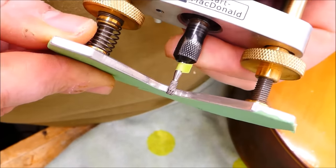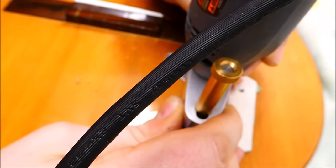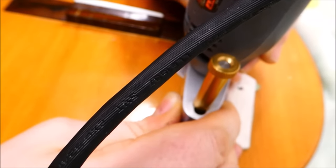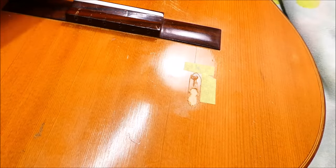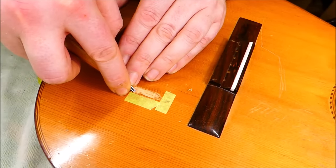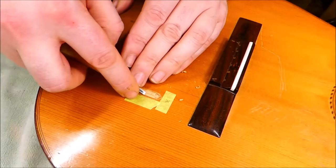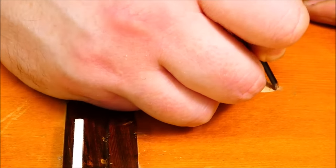With the plug held very carefully in position, I'll scribe around it with the point of the knife just to mark it out. Then I can remove the plug and deepen those incised lines until they're about the same depth as the damage in the soundboard. I'll use a small high-speed steel cutter in my Dremel tool. I'll leave a little around the outline which I can pare away with a chisel - just going to get rid of the bulk of the waste. I'm using small Japanese carving chisels. These have pretty long bevels on them - they're ideally suited for use in softwood. I can also use them as an ultra-fine scraper to get into the corner.